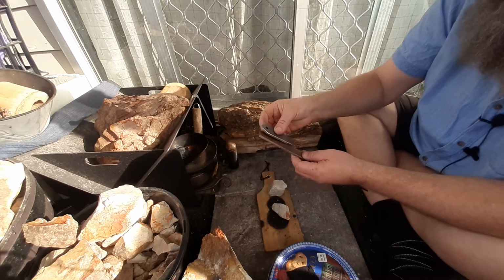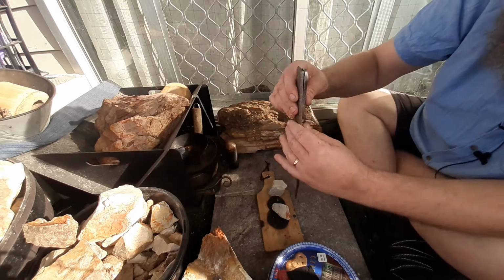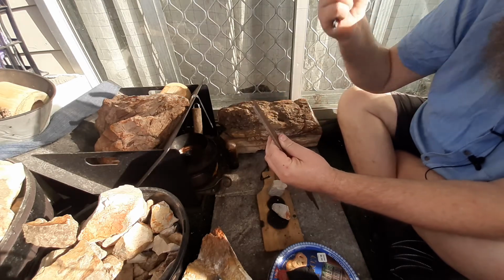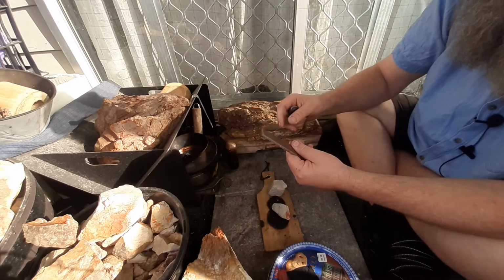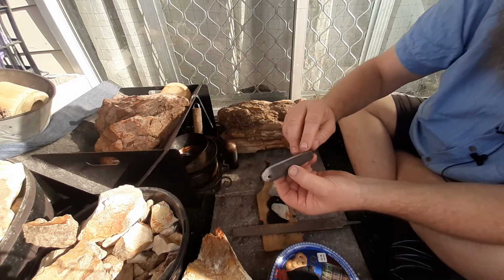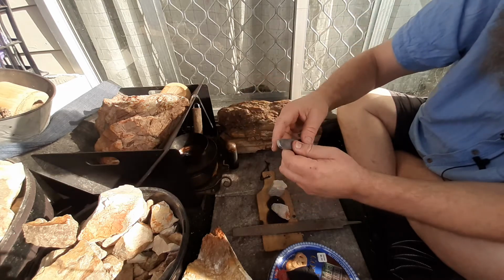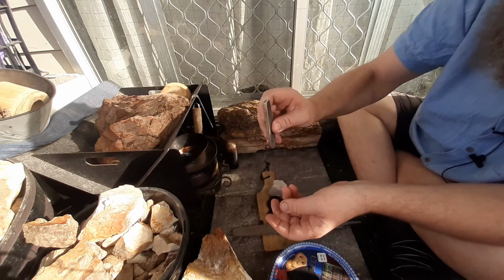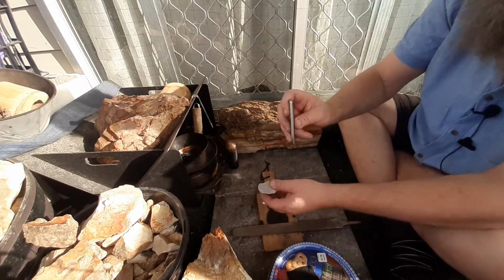Just as I said, put it in a vise. They are fairly brittle. Put a piece of cloth over it and hit it with a hammer. The cloth will stop it from flying all over the joint, because you don't want it flying away from you. Then just hit it on a grinder, dipping it constantly. Grind the teeth off and do the bevel too, and leave the teeth on the side here so that it gives you good grip. I suggest cutting it down to about that size.